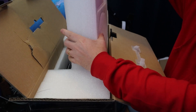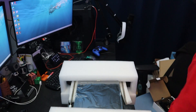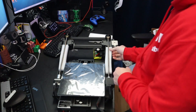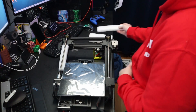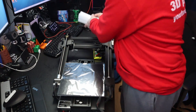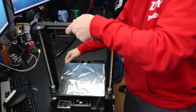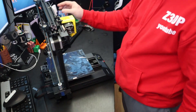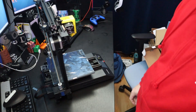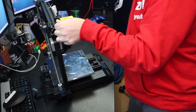I started unboxing, assembling, and preparing the 3D printer. I noticed something when I pulled it out of the box — a brand new Odin 5 F3 is usually wrapped around the middle part to keep the gantry level with the base. Since it's a return, I expected some differences. When I took the foam off the sides, I noticed on the left side there's a lead screw with a holder on top featuring a bearing, and that one was bent.